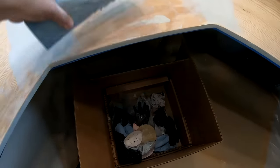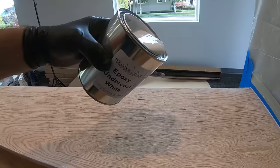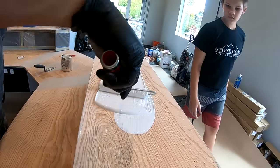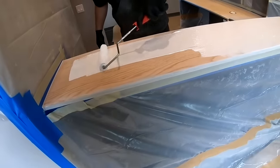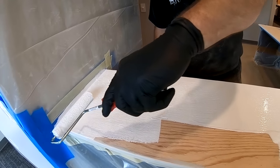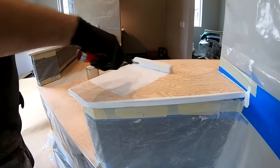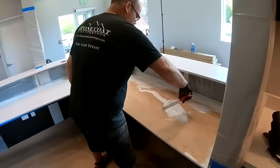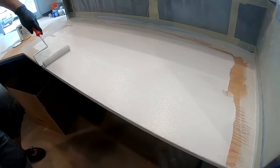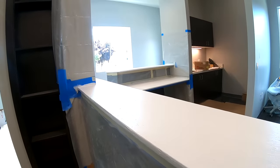It's time for step three — we're going to apply our undercoat. This particular recipe calls for white. We're going to do two coats with a quarter-inch nap roller, sanding in between each coat with 220 grit, rolling it on just like paint and cutting in the edges with a brush. This gives it a beautiful undertone and starts to hide the fact that this is plywood. The undercoater dries extremely fast, so I get to move on with my production and get this job from concept to complete.